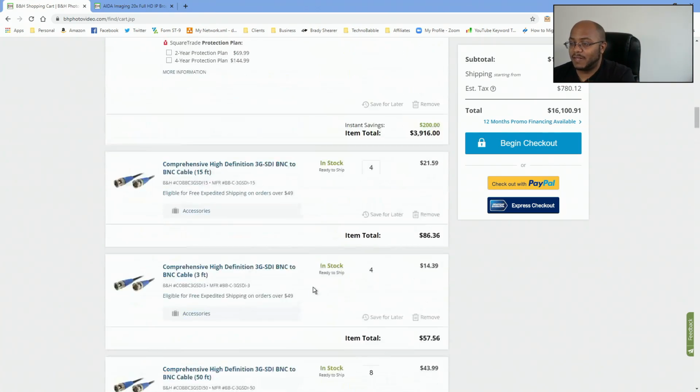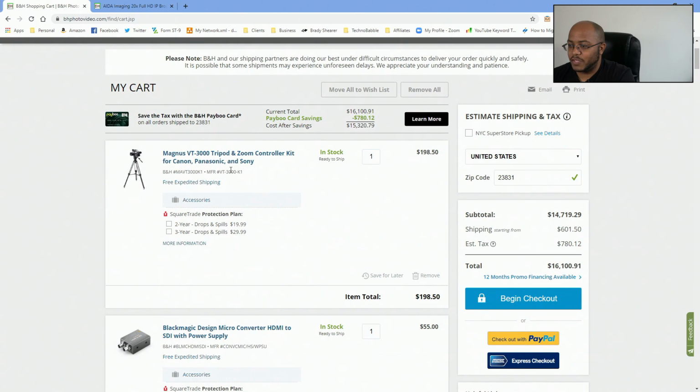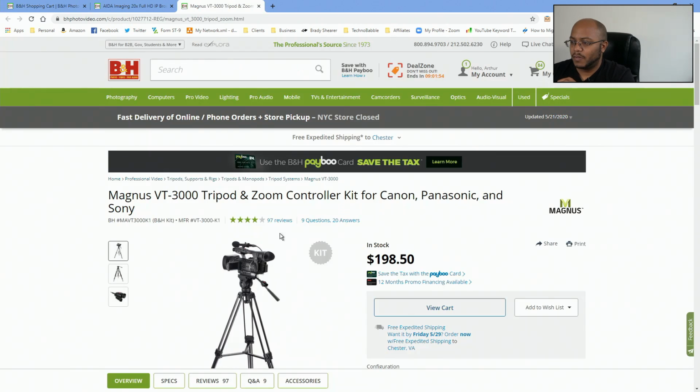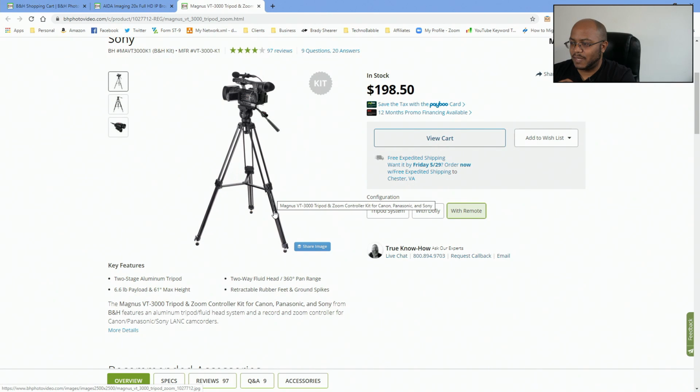We're going to take that camera and put it on this rolling tripod, which I really like, as well as an HDMI to SDI converter with power. So we're going to have a power strip strapped down to one of these legs so the camera and the converter can plug in. Out of the camera, the Canon G50, HDMI goes into that box and converts over to SDI. The cable will be tethered with maybe a loop of 100 feet of cable, and then it just plugs into one of those jacks on the left or the right side of the sanctuary.